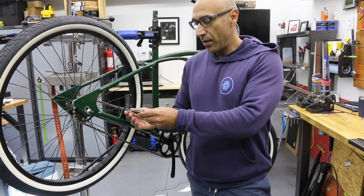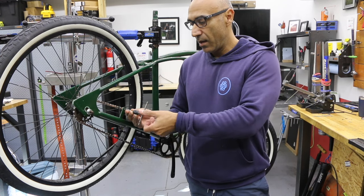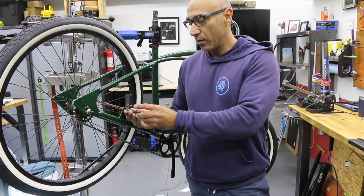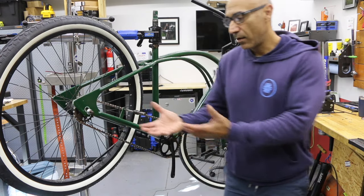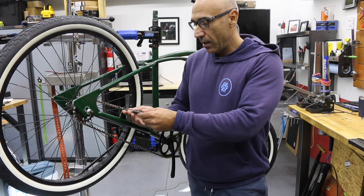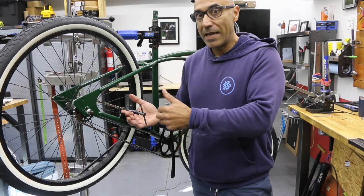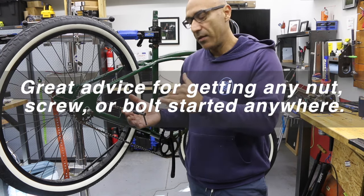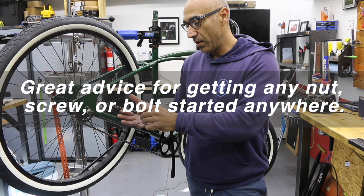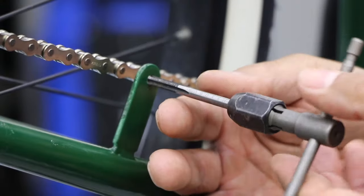The taper should help you catch. Then we're just turning very gently — just fingertips — and I'm going to hold that position with this hand. Do another turn until I start to feel some kind of grab where the tool starts to hold itself, and then you can kind of stand back. As long as your tool's not too heavy, you don't want it to drop right out. Everything's pretty light here and I've got a pretty good grab. You want to feel consistent pressure — you're going to feel resistance. Anytime it starts getting tighter and tighter and you feel yourself using more and more pressure, you want to put on the brakes. Make sure you're going in straight and that the tap is the correct thread pitch. Once you start putting a little more pressure, I'm starting to see some debris come out — and you know you've got a good catch.